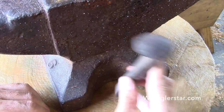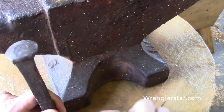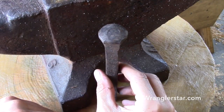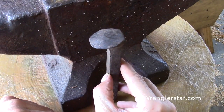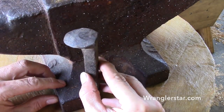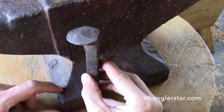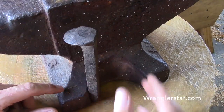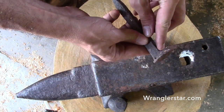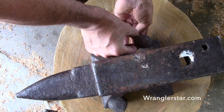One thing we want to do, if we really want these to hold tight, is we don't want these to go with the grain. We've got our tree rings running around here — if we put it this way, it's not going to hold near as tight and it's going to tend to split the wood. But if we turn it 90 degrees to the grain, it will hold very well, even at 45. We want to put one here and a second one on the other side, because they're going to be opposing each other. As you hammer that taper down, they're going to force the anvil away from each other and hold it securely. That's the theory, anyway.